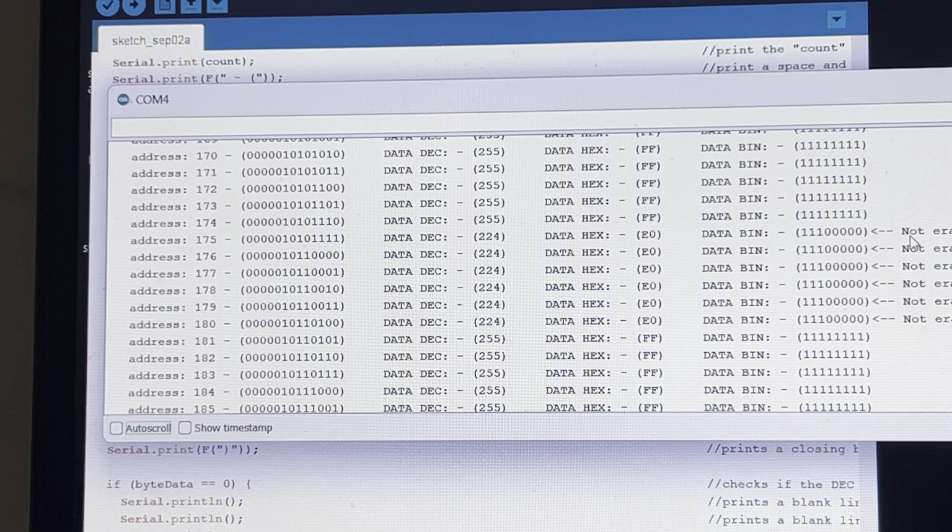It'll tell you that these cells have not been erased. But look at the way it shows you. You can see that it's 0, 0, 0, 0, 0, and then 1, 1, 1. So individually, it's telling you which cells are not erased. For example, this would be in binary format. The number on the right side would be the least significant, and the left side would be most significant. So this tells me that the first, second, third, fourth, and fifth cells are not erased, and the rest of it are good.